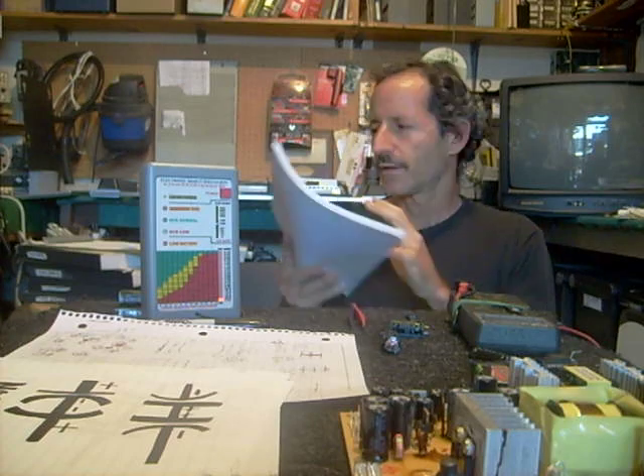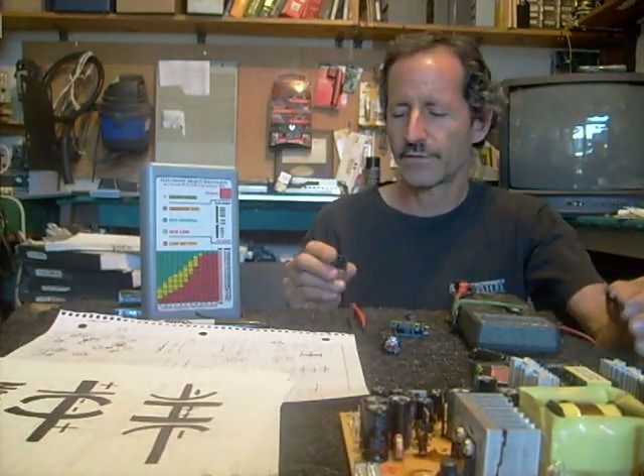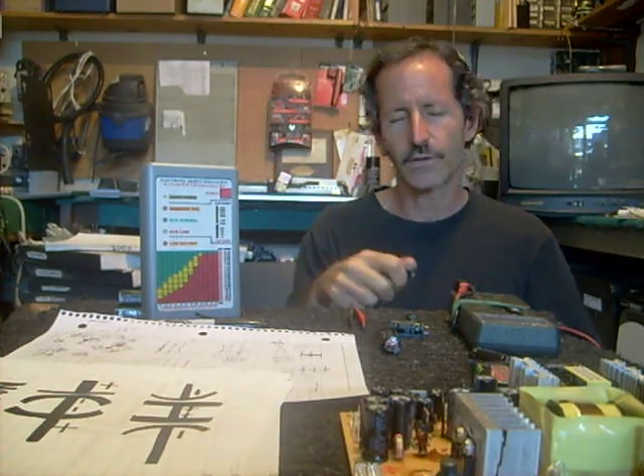So we'll find the same problem over and over. Just a couple days ago, I looked up a Sony TV in this book — it told me what to do, and I didn't even have the schematic on it. It told me to replace this regulator, this horizontal output transistor, a resistor, and a couple capacitors, and I was good to go. $150 repair from a $43 book.